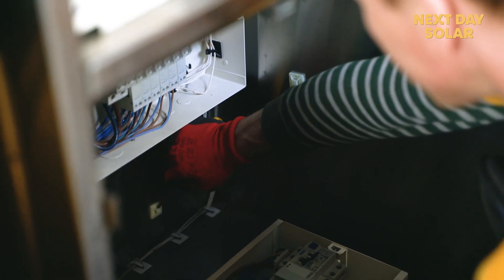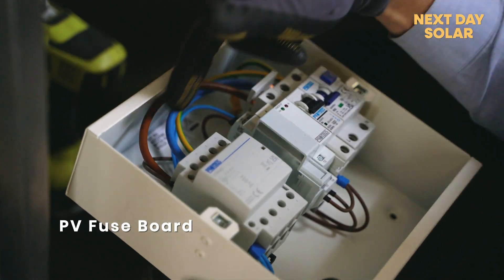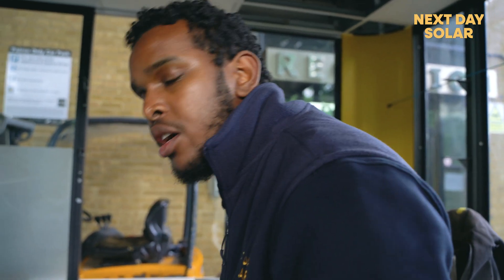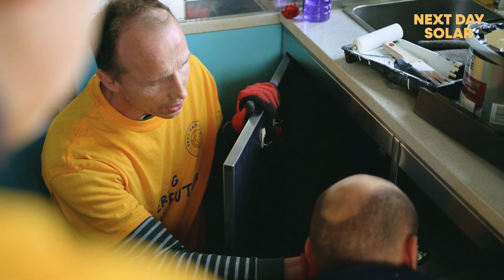David is fitting a new fuse board that will include the PV — that's going to be the PV fuse board — and we're also going to have a second fuse board located in this area. Because of the previous system being separated into fuse boards, we're maintaining that arrangement purely to manage the power and share the load.